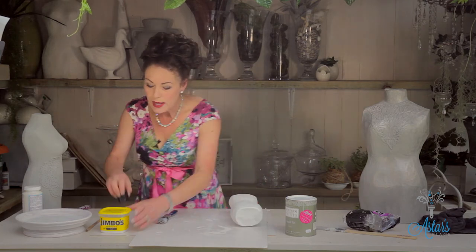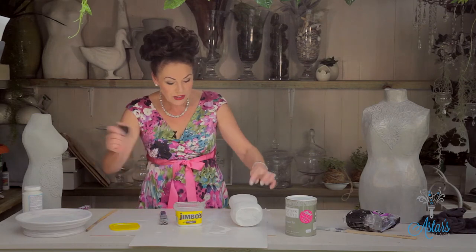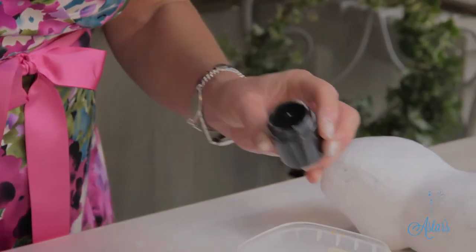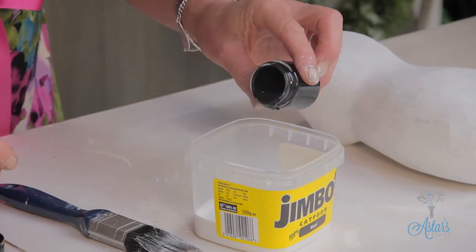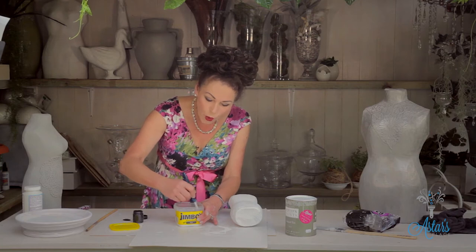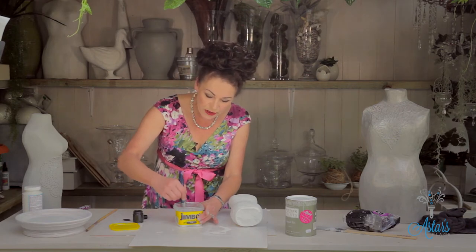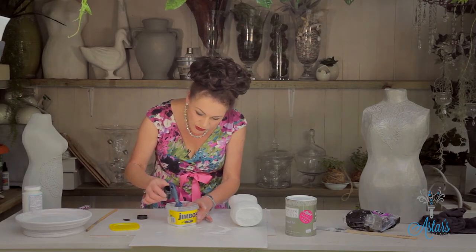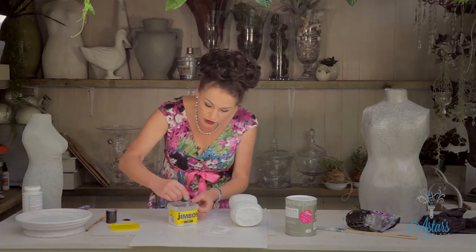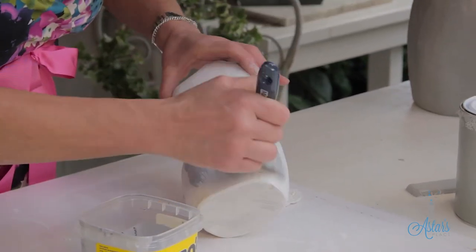The next process is — I've put one coat of undercoat on. What I like to do next is retint: get another coat of undercoat and instead of leaving it just white, put a little bit of tint into it to bring it up to a grey colour, so that you don't have to use too many coats of paint. I discovered that when I went over white, the white kept showing through. So I just decided the best way forward is to tint it up. I put a little bit of plain everyday black, or a black tint you can buy from your paint merchant. Give that a really good thorough mix.